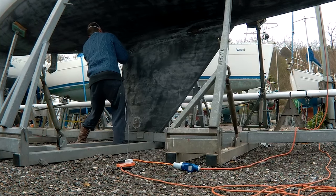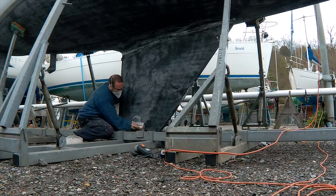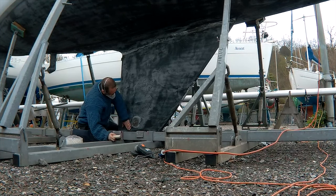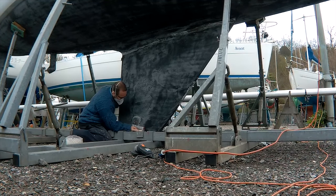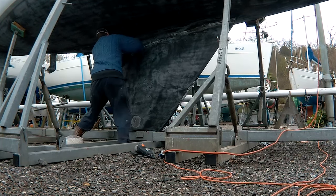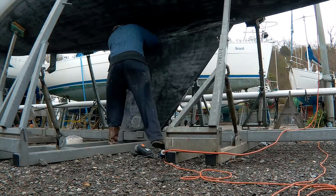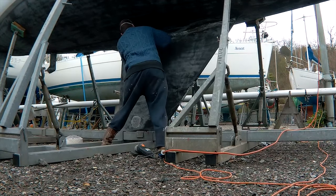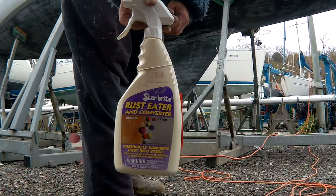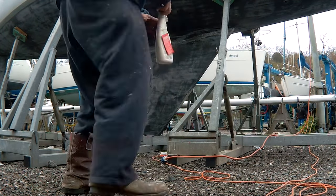The keel is rusty, but we're not worried — steel rusts when it's subjected to water if it's not protected, and that's just what happened. Our keel had been refitted in 2009 when Seahorse had a full strip and sort out for racing. The whole joint seems good, there has never been any apparent movement, all the bolts are still tight and rust-free. The problem comes from the way it has been fitted and faired — as part of its refit for racing, the keel had been completely stripped and covered in filler.